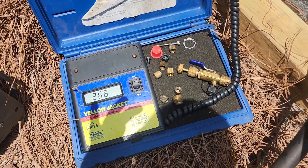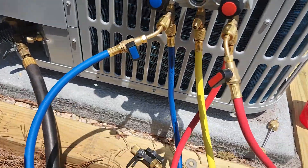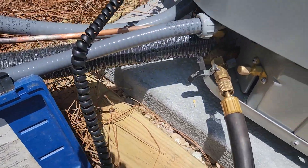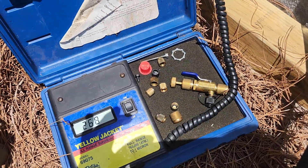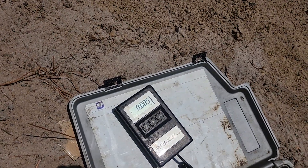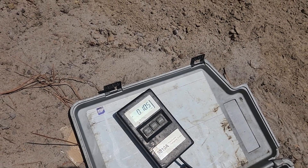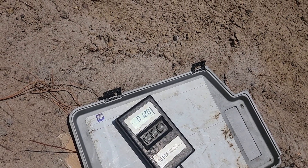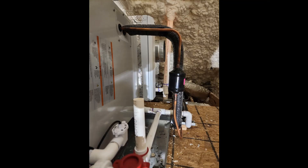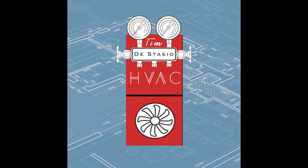We passed our decay test. While waiting, I got my Sauermann manifolds ready to break the vacuum. The valve was closed — we were holding our vacuum just fine. Then I put the Schrader valve back in and broke the vacuum with the field charge, which was about six ounces of R-410A. Now that everything was installed, we were ready for final inspection, and I was really happy with how it turned out. The next step will be startup and commissioning of the entire system — but that will be a video for another time. Thanks for watching.